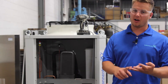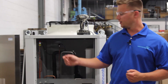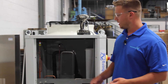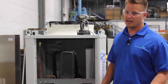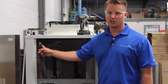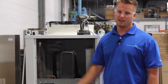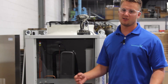Now I want to talk about protecting our compressor. Earlier we talked about maintenance on the condenser coil — after you hose it out with either water or compressed air, if the unit goes out on high pressure because it's too dirty, it's okay because we protect our compressor. This unit comes standard with a manual reset high pressure switch. In order to reset it and get the chiller back up and running, you have to manually push down the reset button. This should only happen if the condenser coil gets dirty, and it's there to protect the chiller.